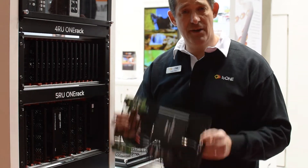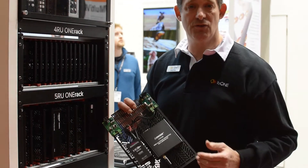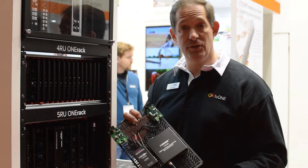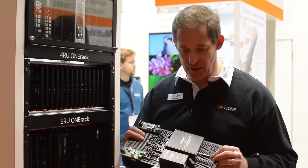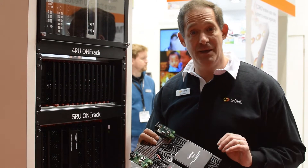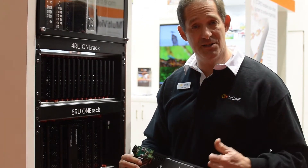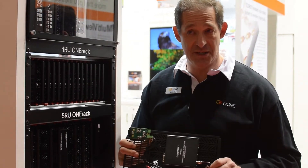The idea is: how do we do a system design? We do the drawings and put them in here. A rack elevation drawing is perfect. As-built drawings give us the ability to zero in on exactly what's failed so we can do service on it. We don't have to tear the rack apart — we pull the module out, replace the device on the module, and put the module back in. It won't be a power supply issue; the power supply is centralized. The rear rail is powered with 24 volts and the modules pull the voltage necessary for the devices on it.